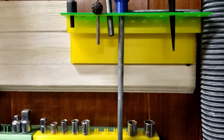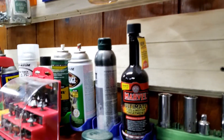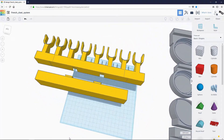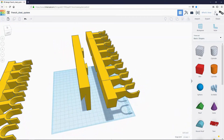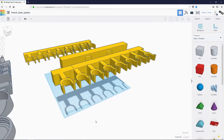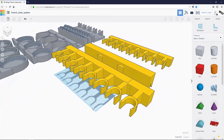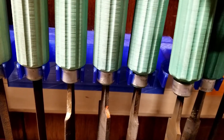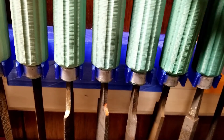Once I had all these file handles completed, I decided I needed something so I could actually hang these files up in my workshop. I have another video where I designed a French cleat system — I just cut out some plywood strips at 45 degree angles and have those mounted above my workbench in the garage, aka workshop, because I have an attached garage I use as a workshop. I used my models already set up in Tinkercad, modified them to work with these files, and it ends up holding about 8 files per section of French cleat — around 280 millimeters of cleat. They rest in there really nicely because they are molded to the actual parabolic shape of the bottom of the file, so they rest in there and they don't come out.